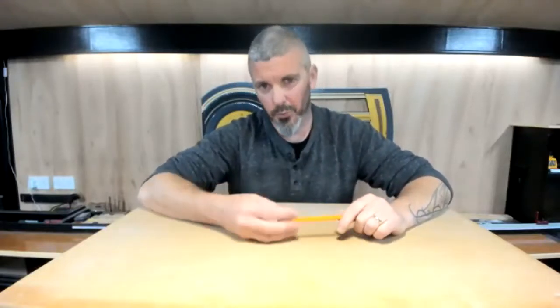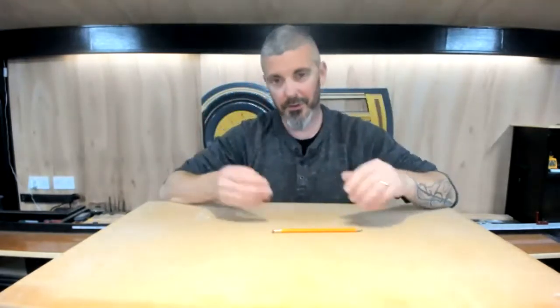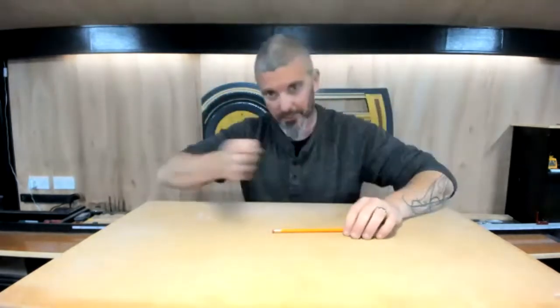But another thing you have to be conscious of when you're spraying, even with spray paints, and I'll talk about those in a second, is that you do not do zigzag. You don't go zoo, zoo, zoo, because you'll get a huge buildup of paint on the sides where you're doubling back on yourself. So you have to go zup, zup, zup, and do it in lines, so you never get that spill on the sides. It's a relatively new thing, but my God, I couldn't recommend spraying a wall highly enough. It's so quick, so easy, so clean once all the tapes are taken off. So that's kind of paints.